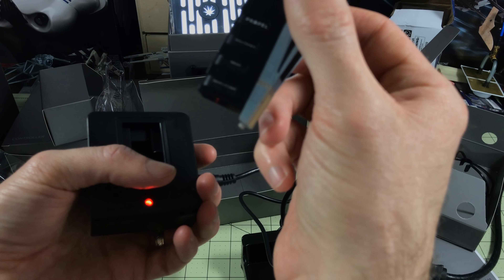Don't fly in the rain. Here's where it gets important: you have to install the propellers. If this is your first quadcopter, this is really important. The A propellers go on the front left and back right when the ship is sitting right side up, and B is in the upper right and lower left. That's really important, because if those are backwards, when you try to take off it's just going to push itself into the ground. The tricky part is that it's easier on the X-Wing than the TIE Fighter — to tell which is which from right side up, but to install them you actually have to flip it upside down. When upside down, A is in the upper right and lower left — the opposite.